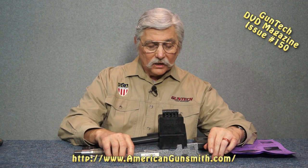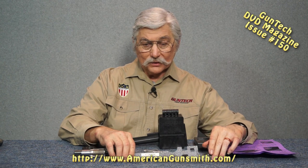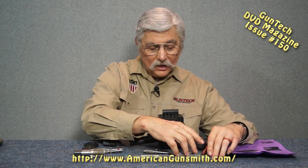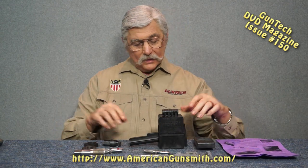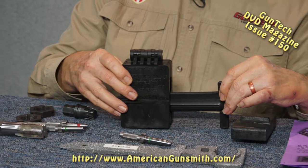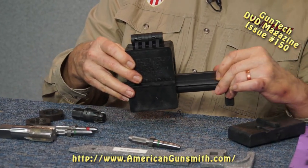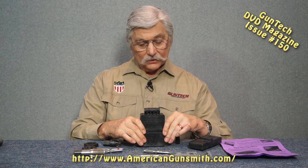You can also use this with a half-inch drive for your torque wrench to get the correct torque. If you don't know what that torque value is - it's not what it says on your spec sheet. There's a formula, and if you look at Mark Foster's DVD on the AR-15 law enforcement armorer's course, that's where you'll find the formula. Here you have your basic jacket that you put your upper through - it goes inside your upper and you clamp the whole thing in a vise. The tube keeps the receiver from collapsing when you clamp down.